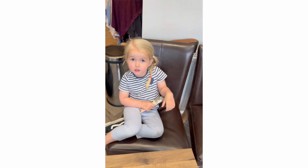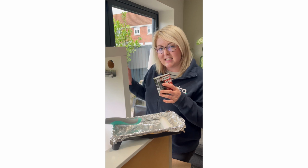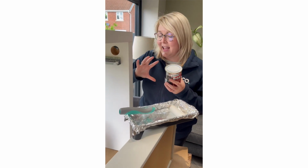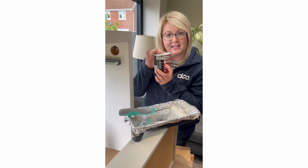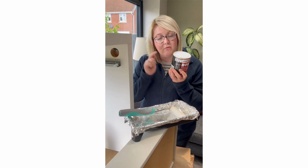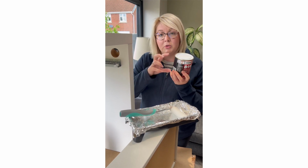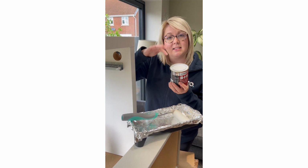And then it's my turn. Most of the furniture from IKEA has this kind of glossy surface, so I find with any type of IKEA flip hack, it's really good to start out with your Zinsser Bin as a first step. And it now also comes in a grey ready mix colour as well as the white, which means that when you're doing something darker like we are with the black, it's already coloured to help the coverage.